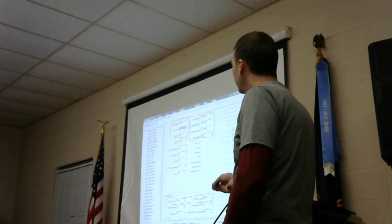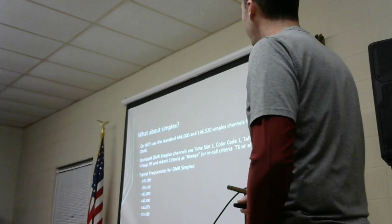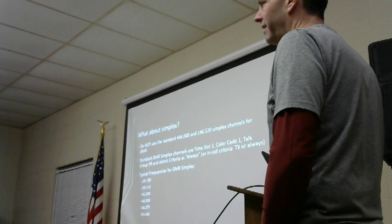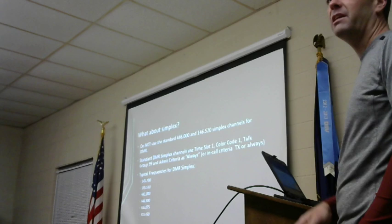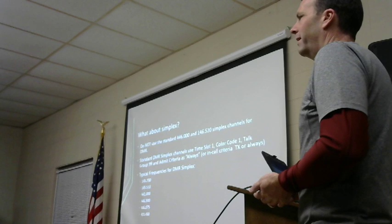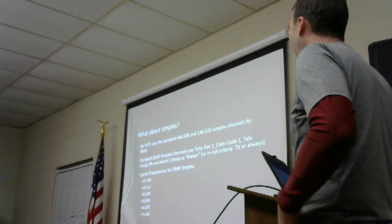Simplex. So if you want to talk simplex, and I've done this a couple times just because we wanted to try it, don't use the standard 146.52 or 446 calling channels. If there's other people actually using those, they won't be very happy about it. I don't know if you've read lately, some people are complaining about people setting up their hotspots on the satellite subband, and they're trying to work satellite, and they're hearing DMR traffic. And if people argue about this, well, this isn't an FCC rule. No, but it's the band plan, it's the gentleman's agreement. You should probably go by it just to make sure people don't get mad at you.